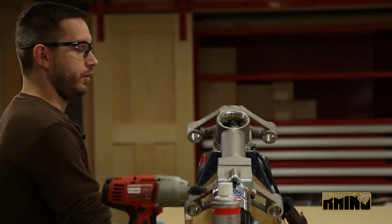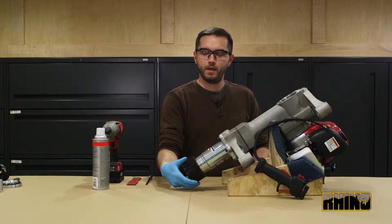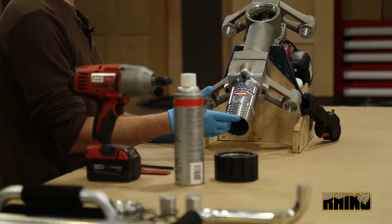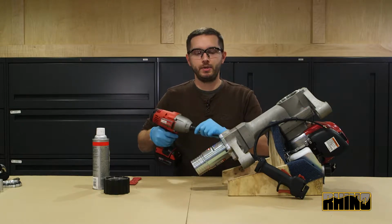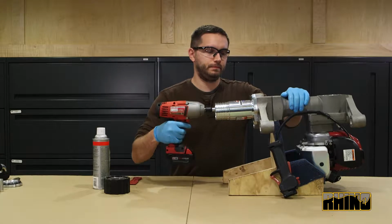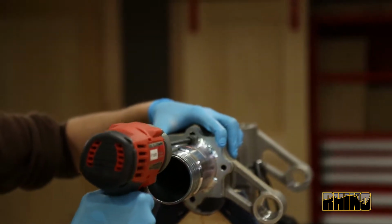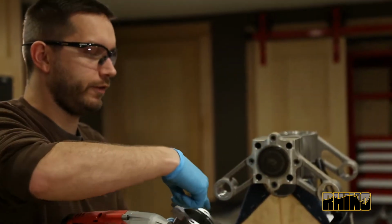First, you'll remove your chuck lock nut, which is a toolless design. The Ranch Pro model has a pin and clip system. You'll want to remove any adapters that you have in the system. Using the 1/4" hex bit socket, you'll remove the chuck bolt. You will inspect the inside for any wear.